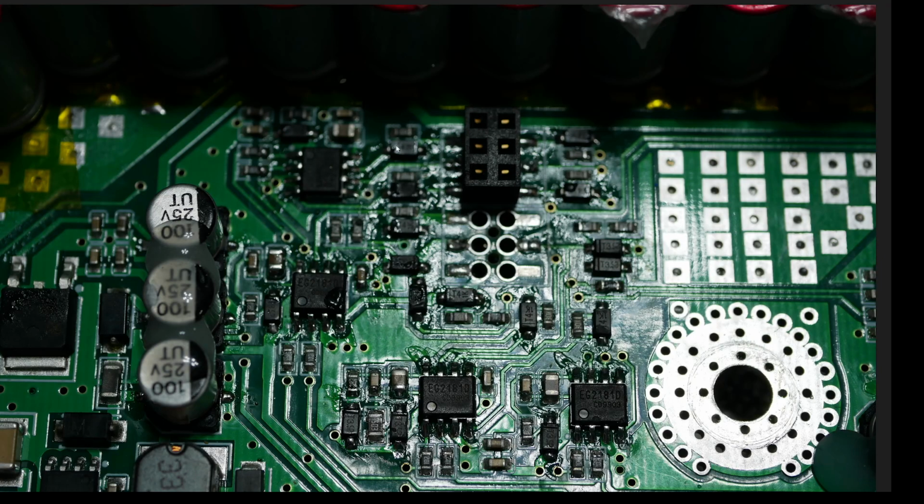That's what this means. When this kind of level of damage occurs and you have to do this level of repair, that is because you had a catastrophic failure on your power stage and it took all this stuff out too. I have repaired stuff like this. I know what to look for. You see this kind of stuff. Except, of course, if I did this work, you would not see flux all over the place. You would still be able to see the shiny solder, because I still hand soldered the parts. But you would see no flux. It'd be very, very clean. It wouldn't look sloppy like this does.